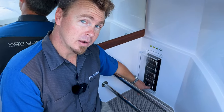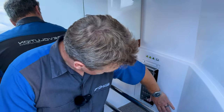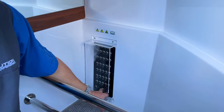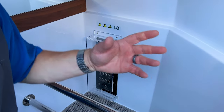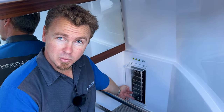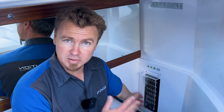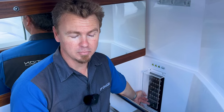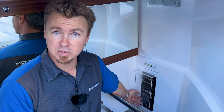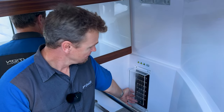Outside those pop-out breakers there are a few user-interactive things. First is a 12-volt plug — lift the flap and use any standard 12-volt receptacle. To the left of that is a fresh water pump button, which turns the fresh water system on; the fresh water pump is located in this room. Next to that is the macerator pump button we mentioned earlier — the momentary switch you press to pump the holding tank overboard. You need your through-hull open for that, and you must be in an area where overboard discharge is permitted.